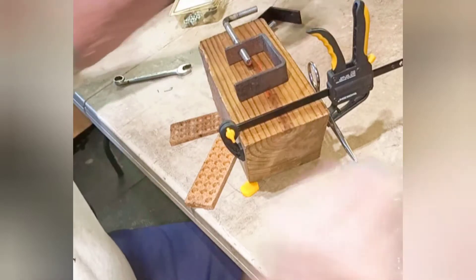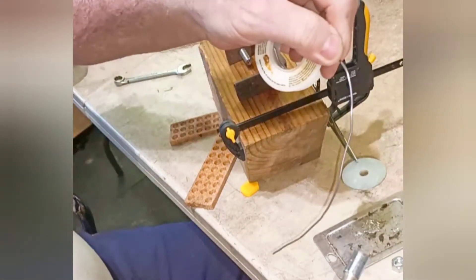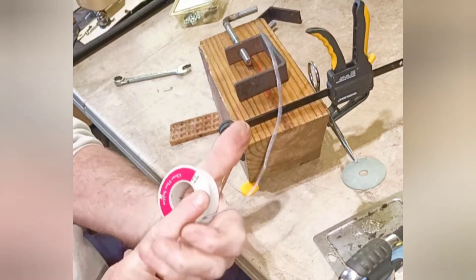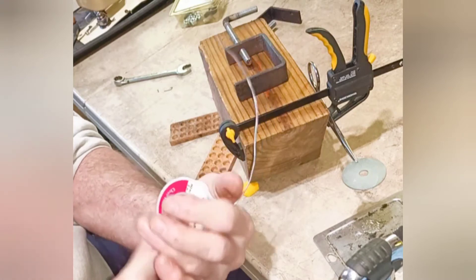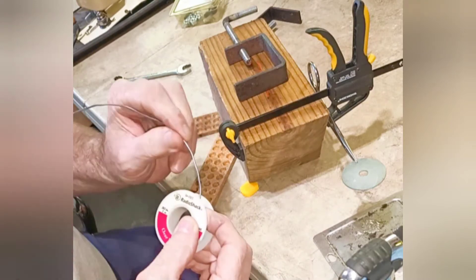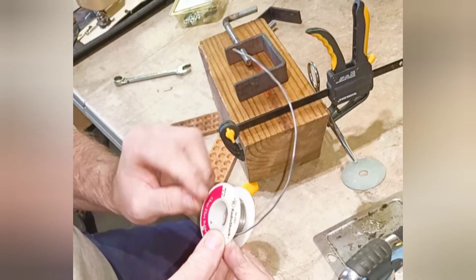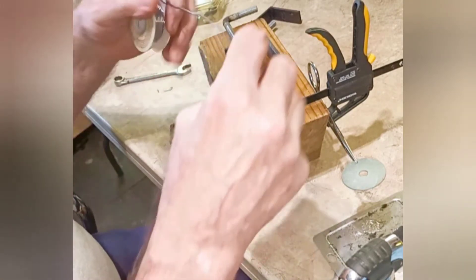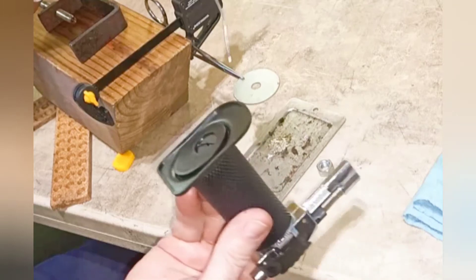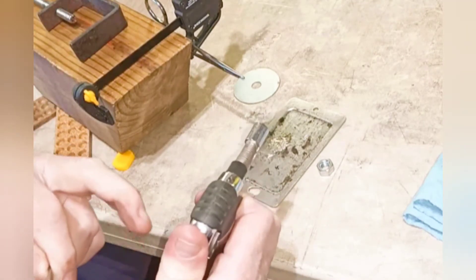This is hot work, so you'll notice I'm getting away from it with my fingers. He's holding his solder at a distance. This is 60-40 solder — that means it's 60% tin and 40% lead, and it does have clear flux inside of it. It came from a defunct place that used to be Radio Shack. This is called a hobby torch — you fill it up with butane through there, and it clicks. It's got a piezoelectric start.